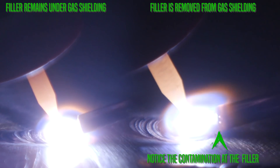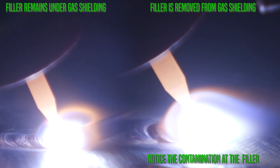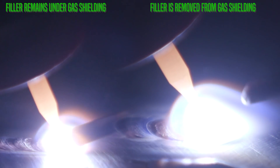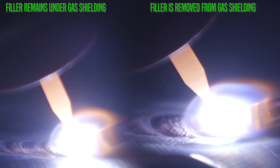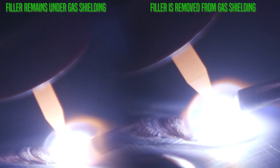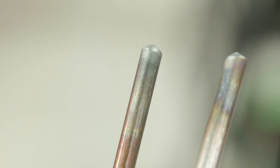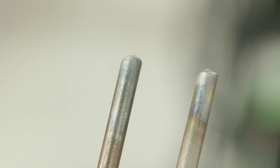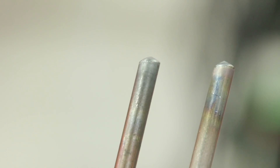You can see the oxide burning right on the edge. See how you can tell — your puddle will have a little smoke around it, telling you you're contaminating the puddle. You can actually see the black right there — that's because you're contaminating it. You can also tell by the filler wire. The one on the left is bad — it's contaminated. That's why you don't pull your filler wire out. Your puddle will actually feel sluggish and you'll notice black stuff on the outside of your toes when you get done welding. The one on the right is not contaminated.